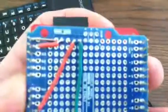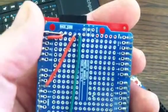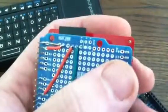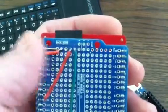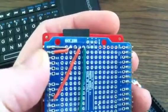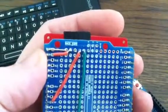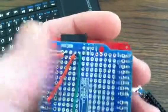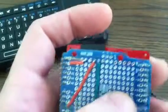And there are 4 pins that are unused by the touchscreen, and those are analog 5 and 4 and digital 0 and 1. So since analog can be used as either analog or digital, I decided to give me some access to the A5 and A4. This is also a typical RX and TX in case you need to use that later for something else.